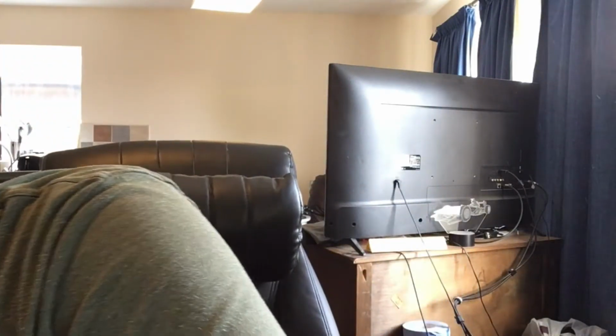Where off camera I've just given the underside of the table a little sanding. Just some water on it. I went with a slightly coarser grit. I wanted around about 300ish, but I seem to be out of those, so it was either 240 or 400, and the 240 just felt too coarse really, so I went with the 400.